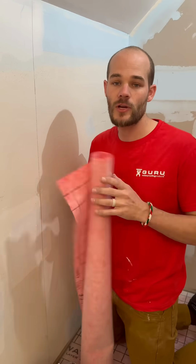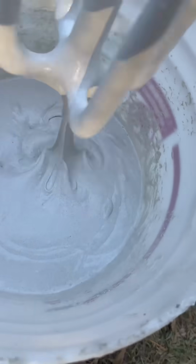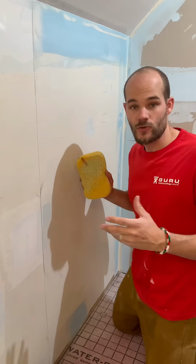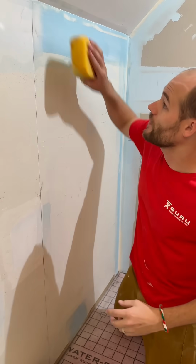In this video, I'm going to show you how to apply Guru's waterproofing membrane. Buy a creamy thin set and mix it pretty wet. When you're putting it on drywall, take a sponge, wet it down first. That will prevent it from sucking all the moisture out of the thin set.